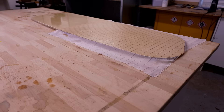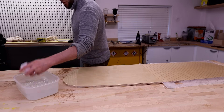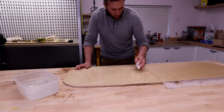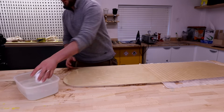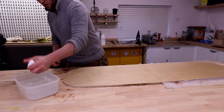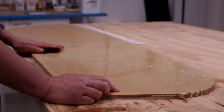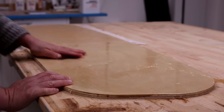So how is this best dealt with? It's quite simple really, and washing is one of the primary ways that I recommend removal. Amine blush can actually be easily dissolved with water, so there's no need to use anything other than that. To remove the amine blush, simply wash the affected area with a clean cloth dampened with water. Warm water will help significantly here, and I would typically use water that is about as hot as I can manage to put my hand in. Regularly rinse out and rotate the cloth as you work over the surface. I usually like to use a scotch-brite type pad for this process, which basically acts like a cloth or sponge holding a good amount of water but will also very lightly abrade the surface as you go.